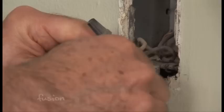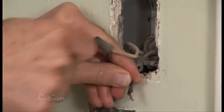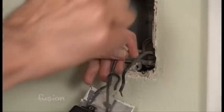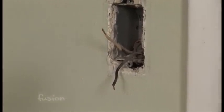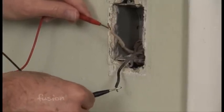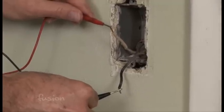All we're going to do is disconnect the wires. Does it matter which one you do first? I guess not since the power's off. And I'm not going to hold them — I am going to keep them away from each other and myself, so we're still safe. Then we use a voltmeter and touch one to the other. I don't get a reading, so there's definitely no power. No power, so we're definitely safe.